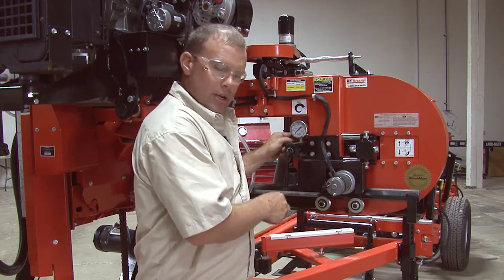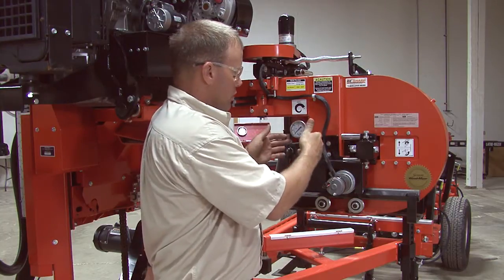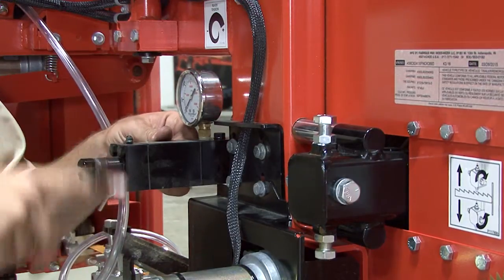It's not just pulling out a plug back here and squirting fluid in there — we have to make room for that fluid to go in. So we'll want to back off the tensioner here to where we've got a couple inches of thread showing.